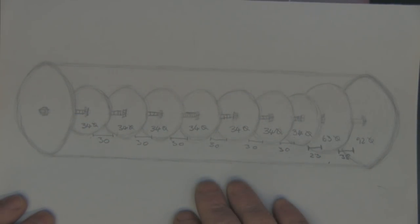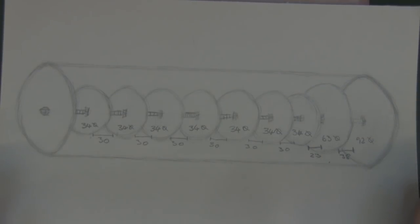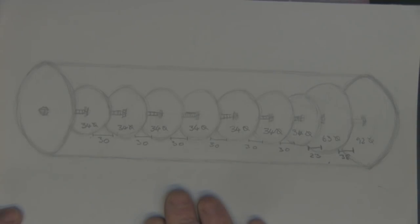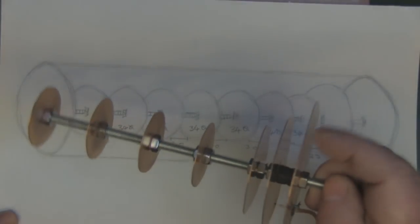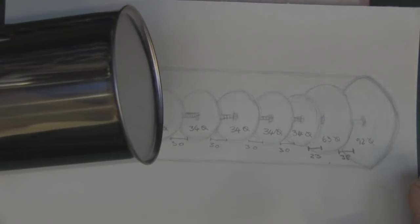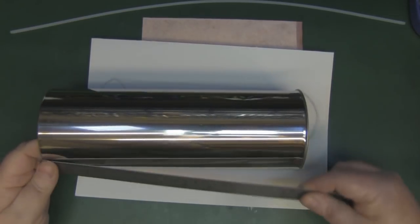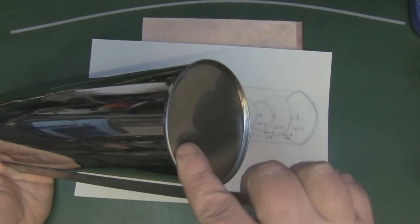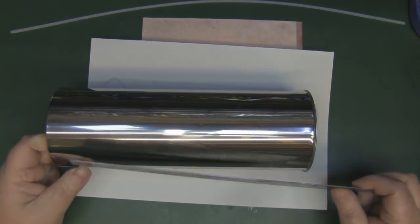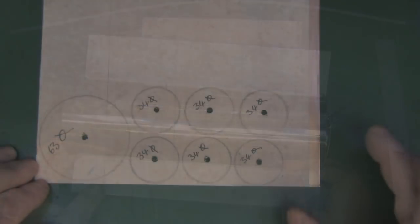Here's the design sketch I've come up with. I've gone for six parasitic elements — the original had seven but I removed one, though you can use seven if you want. I'll make a PDF available in the description. We've got the parasitic elements, the main driven element, and we no longer need a back reflector on the element stack because the back of the cantenna serves that purpose. For the can, I'm using the stainless steel toilet brush holder from previous videos — 226 millimeters long and approximately 90 millimeters in diameter, which is almost perfect for Wi-Fi.